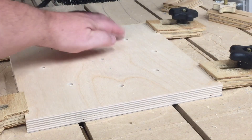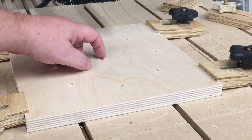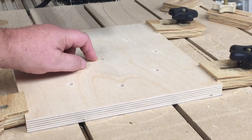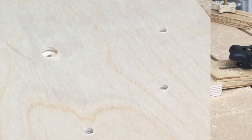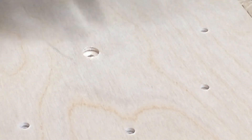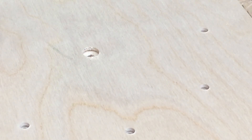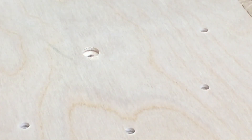Here's our piece with the eight little alignment holes around it. In another video I'll show how I use these to actually turn this into an octagon. The last thing on this side is to cut a slight relief around the center hole for when we put the final bolt in at the end — so the screw head stays below the surface and the whole piece sits flat. The only other thing left on the back is to carve my Cryptic Woodworks logo, because no project is complete without a logo. I'll add a bit more Oramask and switch to the 30-degree pencil bit for that.